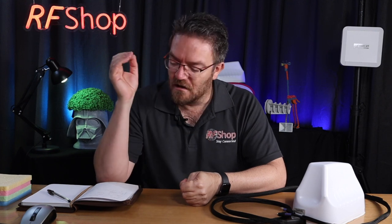They get it right and it does work well, but you will get the best performance out of the package that has the least number of antennas and exactly the number you actually need. So if you need a 2x2, take the MIMO3-12. Don't go for anything higher just because you want more features — if you don't use those features, they'll only complicate the two antennas that are already there. If you need four, take four. Don't go higher if you don't need it.